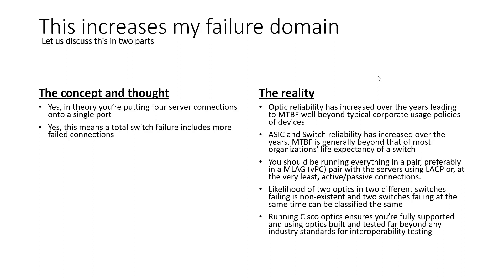Talking about ASICs and switches altogether — in the last decade I saw one switch where part of the ASIC failed and half the switch worked, half didn't. I've seen that once. And total switch failures — in the last five years I haven't seen one completely die for no reason. Our manufacturing methods are getting better. We've learned from past failures to create switches that are ultra reliable, with MTBF for the entire switch — the ASIC and everything — beyond most organizations' life expectancy of a switch in a data center.